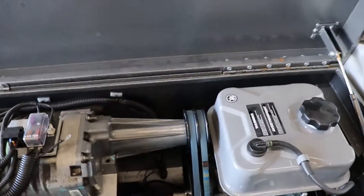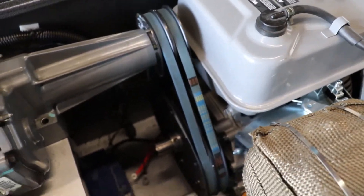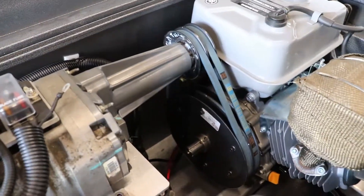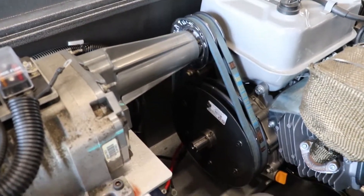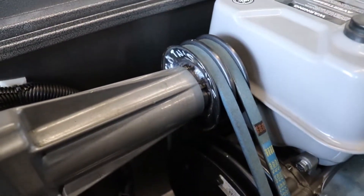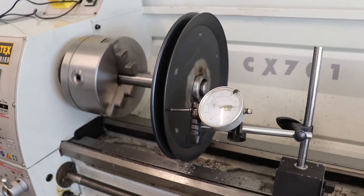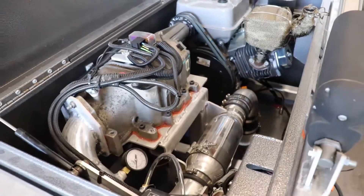This belt system was a custom build. We didn't have a lot of room — we tried single belts and it just wasn't adequate. The supercharger had a six-rib serpentine on it and I couldn't find a V-belt conversion for it. So we whipped these up with some hubs from Princess Auto that we turned on a lathe and some steel pulleys. They've got a bit of wobble — they're not super precision pulleys — but they do seem to work.